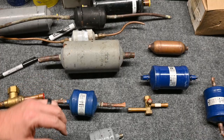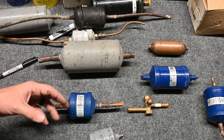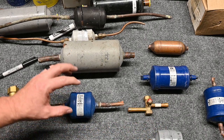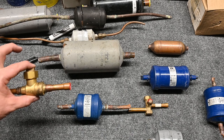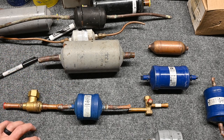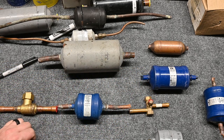Let's say we have a unit with a burnout and I know I'm going to have to come back and change this filter, or maybe it has moisture in the system and I'm trying to save that unit. One of the things I can do is change out the filter dryers — it's going to absorb that moisture and help pull out some of that acid. So I have my existing valve that I'm already working with, and what I'll do is add another valve to the unit. I put my new valve here and my existing valve on the unit there, and it would be something like this.